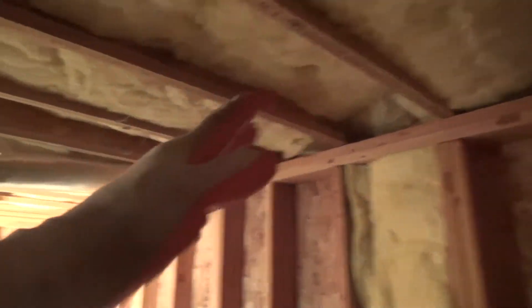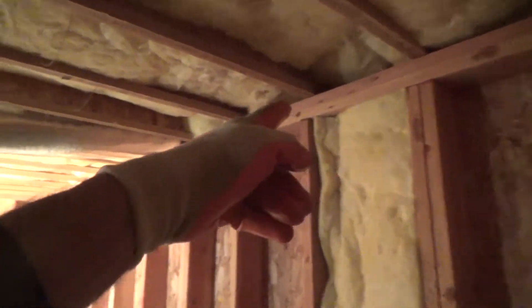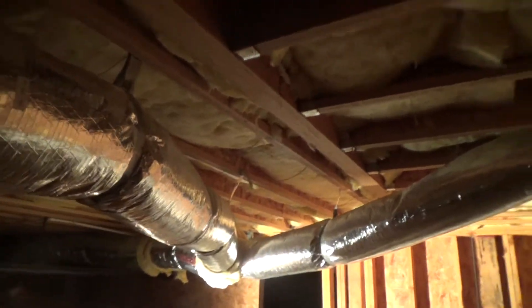That's why they had to come across and stop here, because all the other floor joists went from left to right. They couldn't do that over here because they had to get these to stick over this wall, so they put this huge beam in. It's actually pieces of plywood glued together — at least five three-quarter inch pieces. I was wondering how they extended those, since plywood is only eight feet long. They make these little groove cuts, glue those together, then offset and stagger them, and believe it or not it makes for a really strong beam.